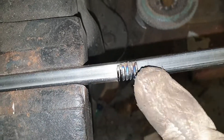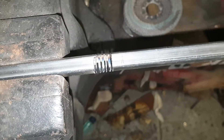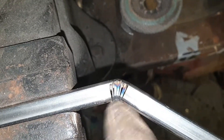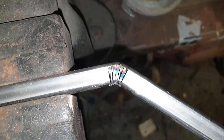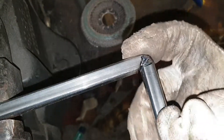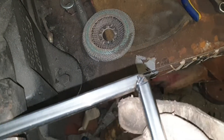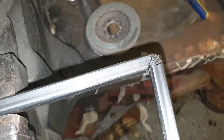All it is is a series of cuts — don't cut the back, just the front — and when you bend it they all collapse and you end up with the radius. If I go tighter here I can get the radius tighter, simple as that, by slicing a bar. I've chopped some more out now, so as you can see there's a nice radius on the outside. I'll weld this all up now, grind it all back off, and once I take the top off we should have a U-channel in the right shape.